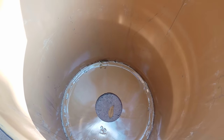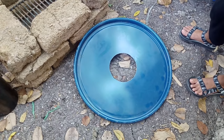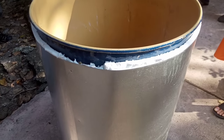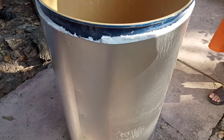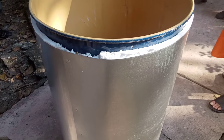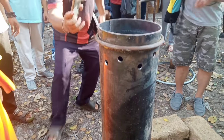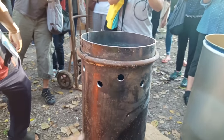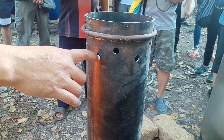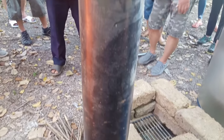This is the bottom of the oil drum — it is a little bit bigger than 6 inches. The hole on top of the lid of the oil drum is the same size. Around the oil drum, we wrap it with ceramic fiber, or anything that can provide insulation. This is the 6-inch metal pipe, how it looks. And then the rebar that we weld on the end of it like this, and the 12 holes that we drill.